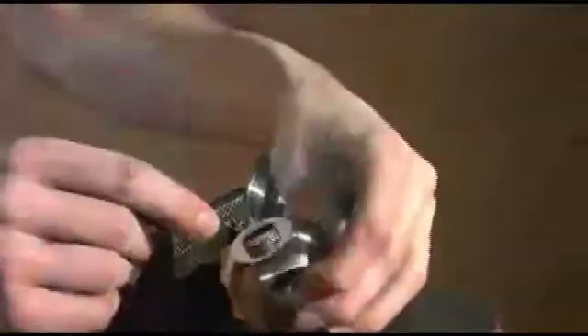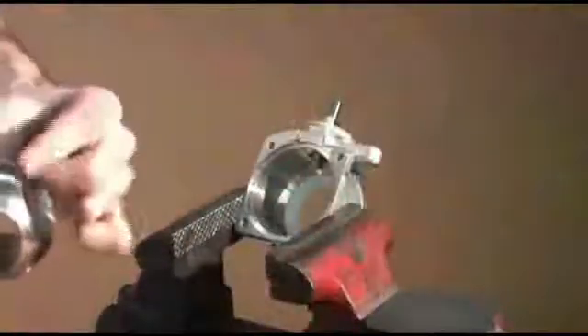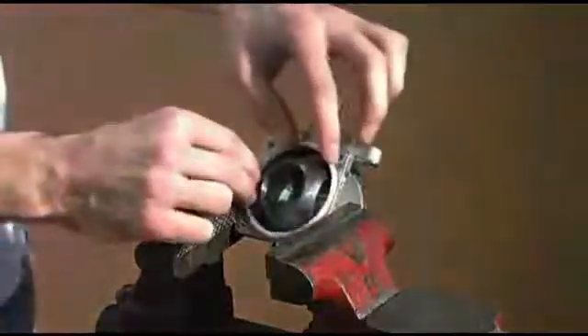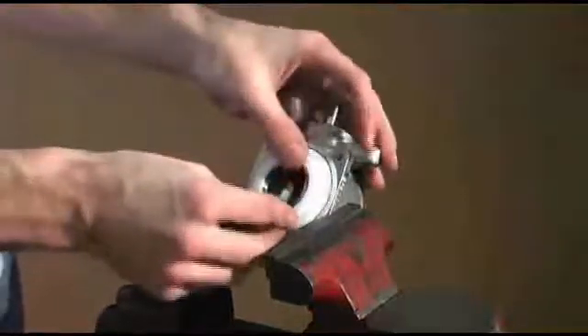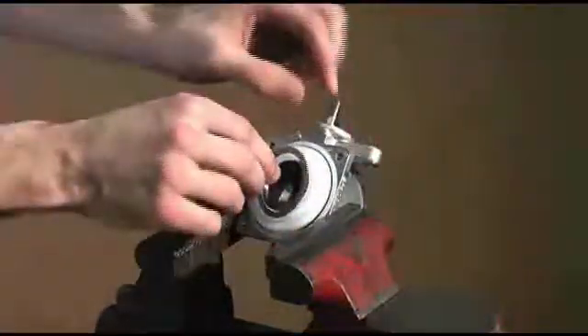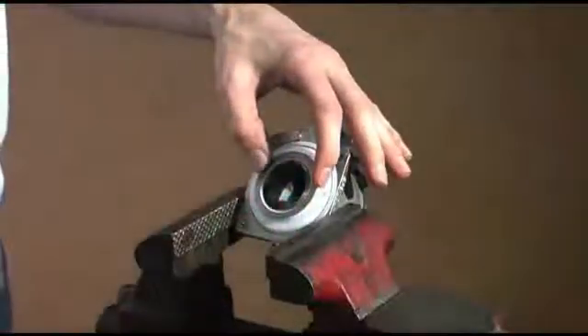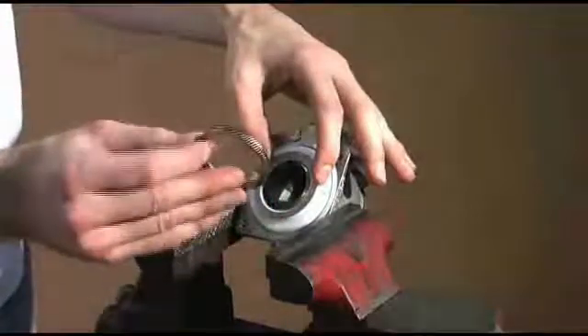Replace the conductivity spring on the ball. The concave side of the ball must be facing the ball seal. Now replace the flange seal, then the ball retainer seal. Replace the wave spring washer with the rounded side facing the ball retainer seal, and then replace your wave spring onto the wave washer.